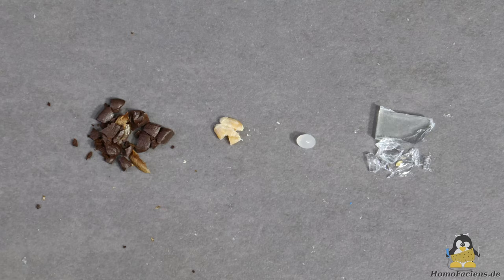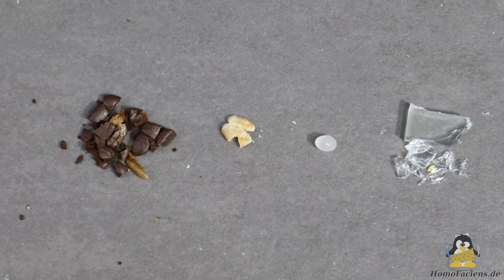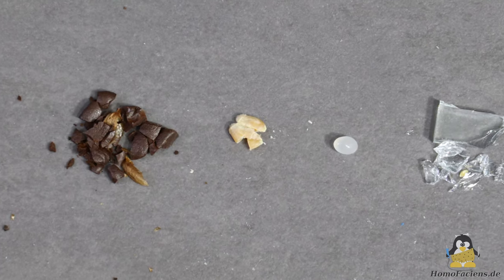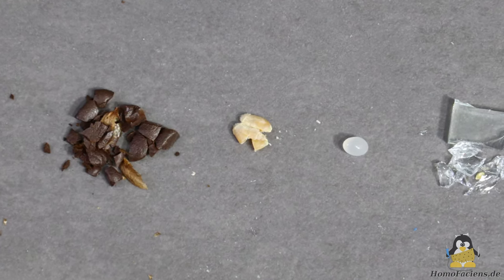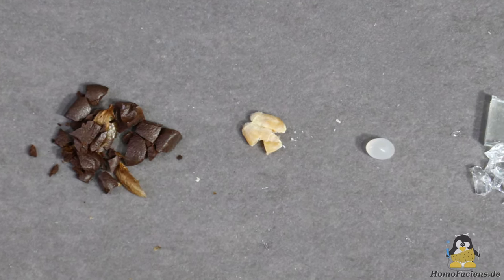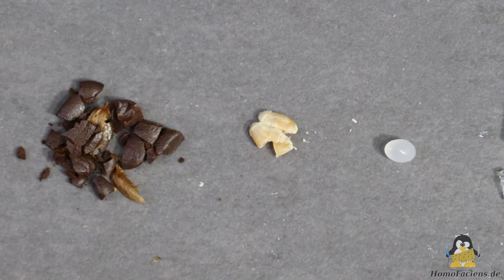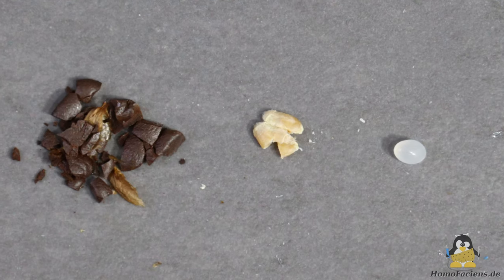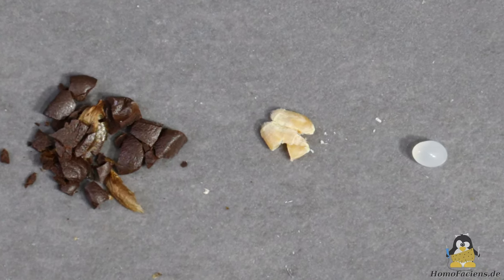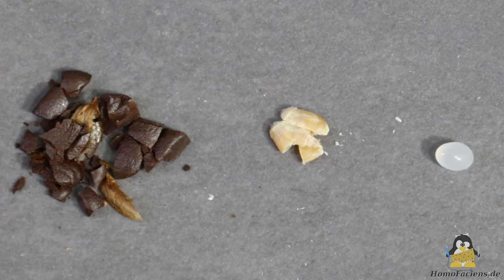The toughest nut in the test series is obviously the plastic pellet at room temperature. PLA only becomes brittle at very low temperatures, so much more energy has to be put into the grinding process at room temperature than is the case with the other materials shown here. Coffee grinders are for coffee and flour mills are for flour, and if you still believe that you can effectively grind PLA pellets with those types of mills, try it out and report your results.